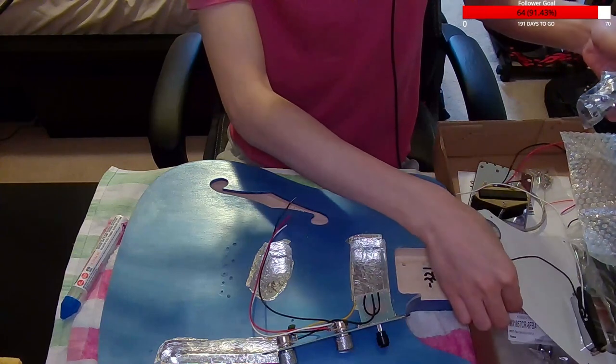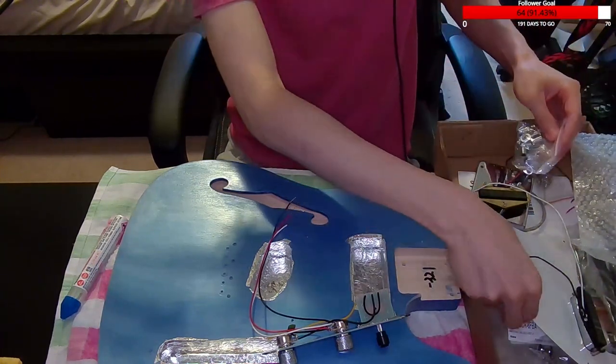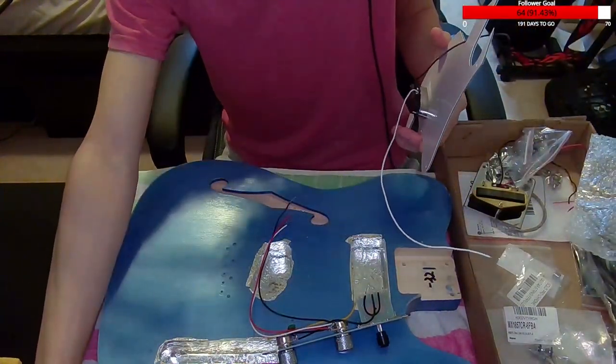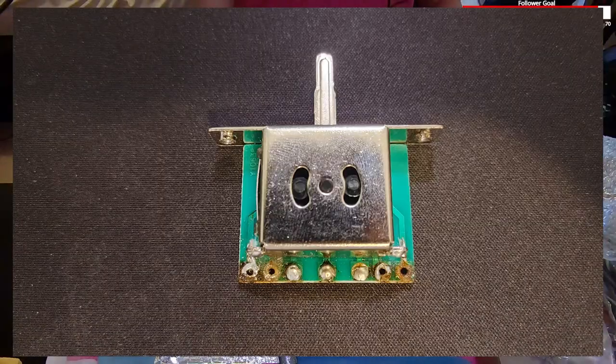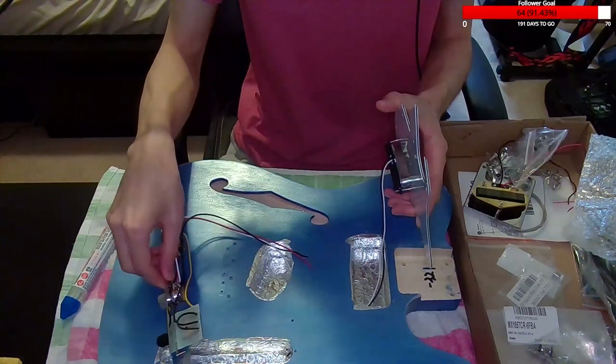On day 3, before streaming, I decided to add aluminum foil shielding to the cavities of the guitar. I used a video by Guns and Guitars, and the video will be in the description below. Next, I soldered all of the parts to the guitar and to the switch, but unfortunately, I burned the contact pins on the switch, and as a result, I had to order a new one. The new switch that I ordered came with metal tabs instead of copper pads, which made it easier to solder.